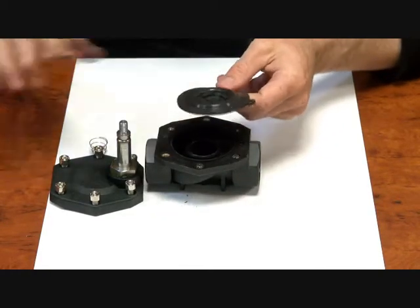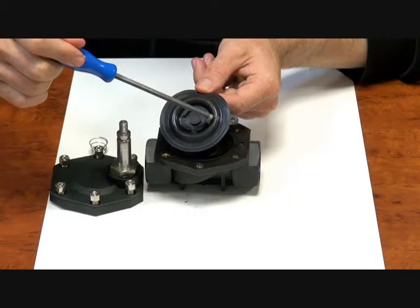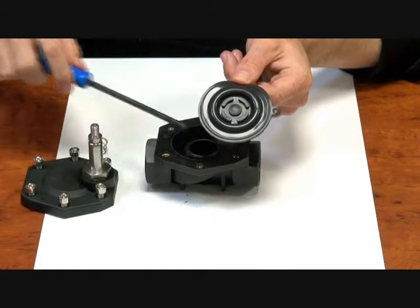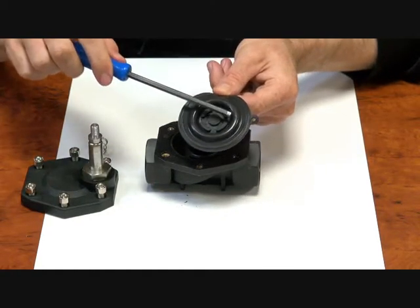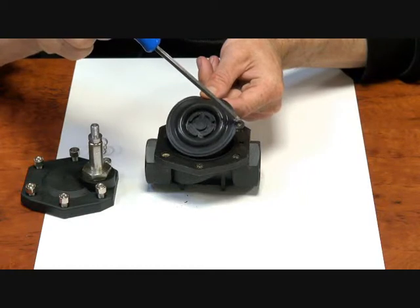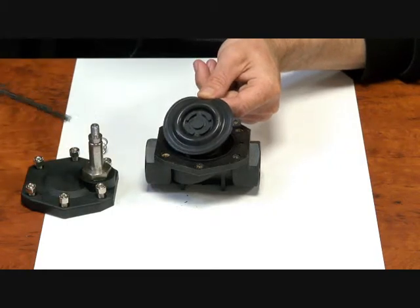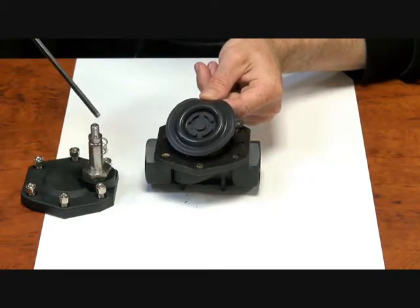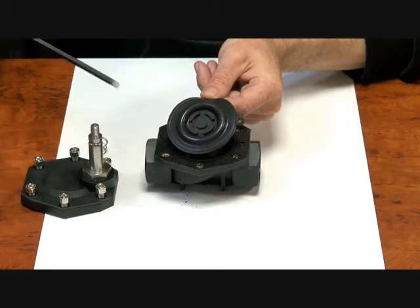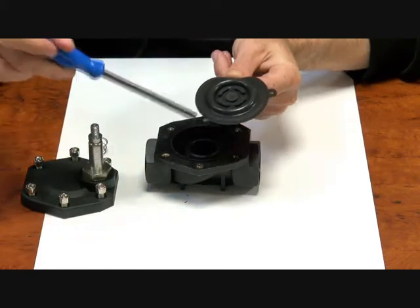If we take that spring off and have a look at the diaphragm — a couple of important things to note here are the two holes in the diaphragm. This one with the dog ear out the side is the one that bleeds off downstream. And this smaller one in the middle of the diaphragm is the bleed on. So the pressure comes through and onto the top of the diaphragm through this little hole. It can't escape because in the closed position the operator is sealed off over the bleed off hole downstream. So the pressure sits on top of the diaphragm and keeps it closed. When you operate the valve, the electromagnetic field is created which pulls the armature up in the operator, clears this hole, and the bleed off hole is bigger than the bleed on hole. So the pressure goes off downstream, and consequently the diaphragm is raised to the roof and you get flow through your valve.